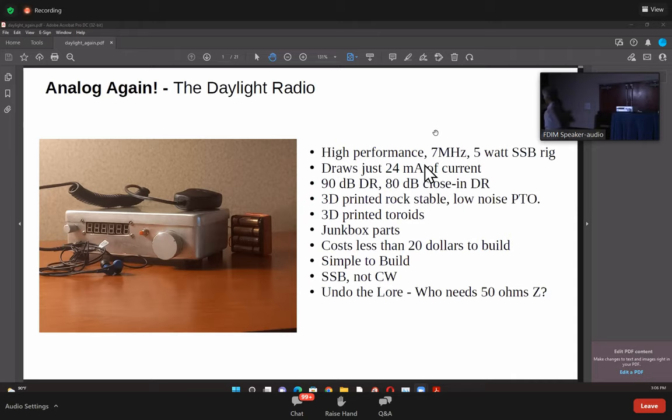So what happens is that all these signals do not stop at the crystal filter, but get through all the way to your ear. So you need to have everything from the audio amplifier onwards which can handle so many signals together. Otherwise, with 30 CW signals coming in on a pileup and poor audio dynamic range, if you're using an LM386, there's no way you'll be able to differentiate them all.